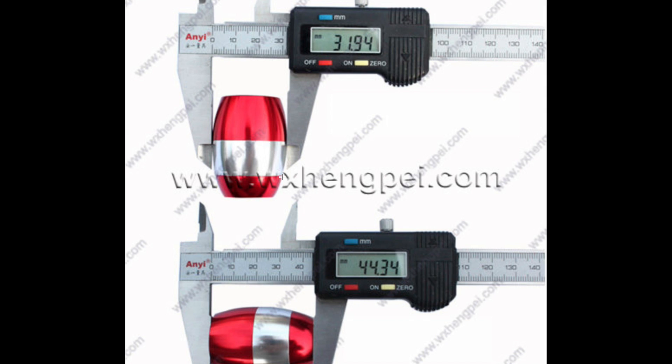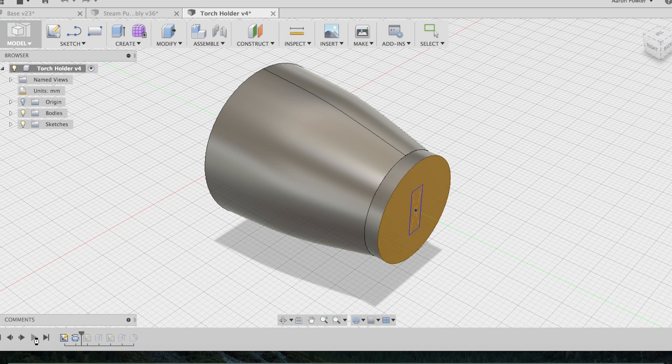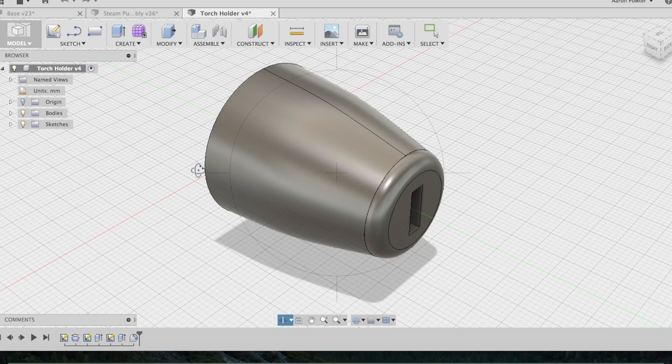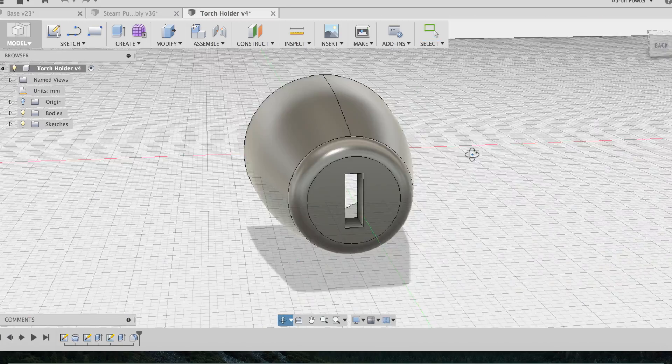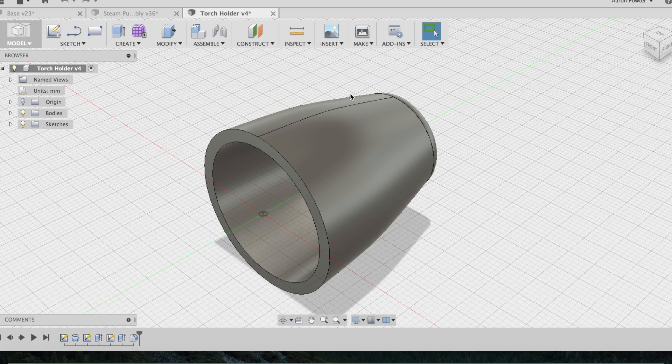The whole lamp was designed around this egg-shaped LED torch, which you can buy off AliExpress, eBay, or usually find at your local $2 shop. In Fusion 360, we drew a profile sketch, revolved that sketch, extruded the end, extruded a cutter slot, and applied a fillet feature. From here, it was exported as an STL file and 3D printed in our UP 3D printer. Unfortunately I didn't get any footage of this as I was busy CNC machining in the other room.